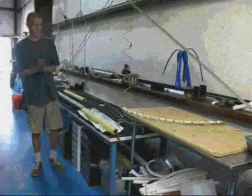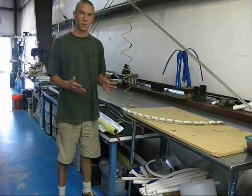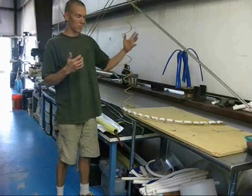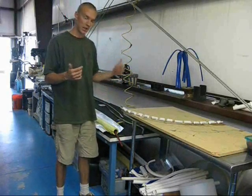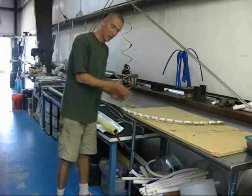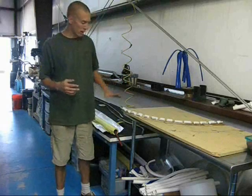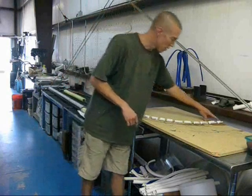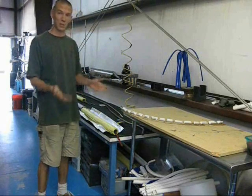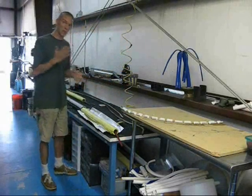You'll notice that my pipe is quite a bit longer than the form I'm setting it into. The reason is that when you're trying to duplicate a shape over and over, it's hard to decide how long it's going to be. The mathematics for measuring this kind of shape are somewhat flawed, and even with a good number, you have to decide: is that for the inside, middle, or outside of the pipe? By running it wild and placing a cut line on the form, you avoid that problem and guarantee very consistent output. You bend and then mark, and at the end make your cuts — producing the same piece as many times as you need.